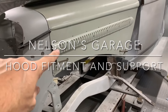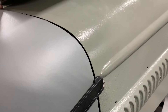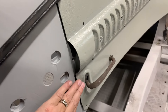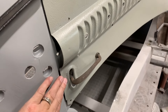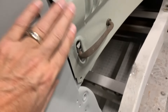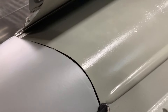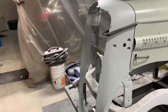I got the nose back on and I'm starting to fit the hood. You can see how this comes together really nicely - it's a little low here but pretty good through here. Since it stuck out like I showed in the last video, I decided to clamp it and now this is really good. This might have to be hammered down a little more. I put a seal in there - the gasket kind of holds it where it's supposed to be. Got the latch on; this feels really good. Now I'm going to put a support in here from here up to here and hopefully that'll hold that in. That's my plan - either that or it could be a complete failure, I don't know.